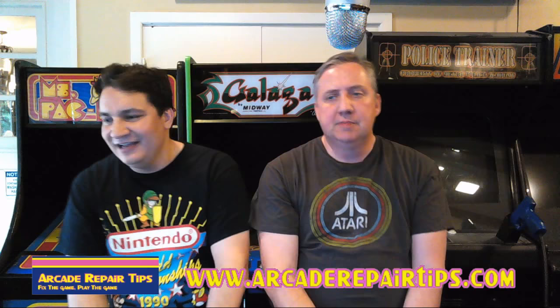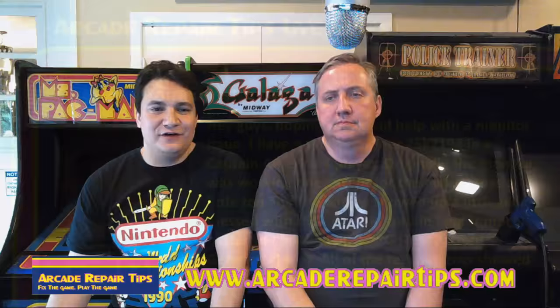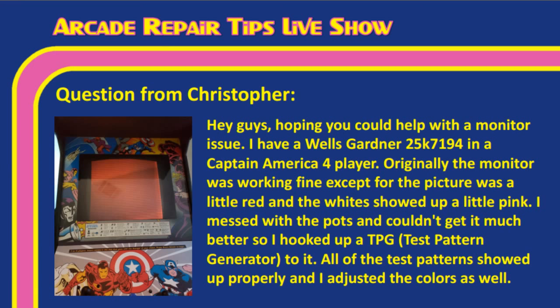So there you go. Okay, well, let's go ahead and move on in our pre-prepared questions. The next one is from Christopher. Christopher writes, hey, guys, hoping you could help with a monitor issue. I have a Wells Gardner 25K7194 in a Captain America four-player cabinet. Originally, the monitor was working fine, except the picture was a little red and the white showed up a little pink. I messed with the pots and couldn't get it much better, so I hooked up a TPG, test pattern generator, Tim, for those who don't know. All the rest of the test patterns show up properly, and I adjusted the colors as well.